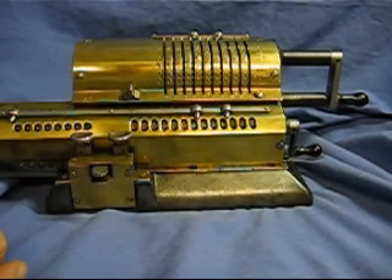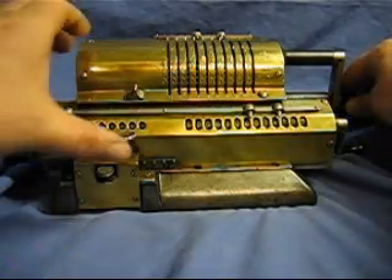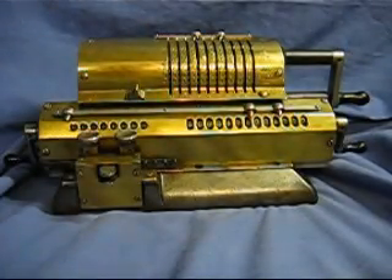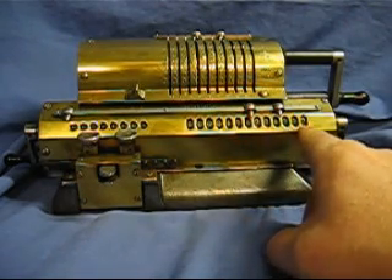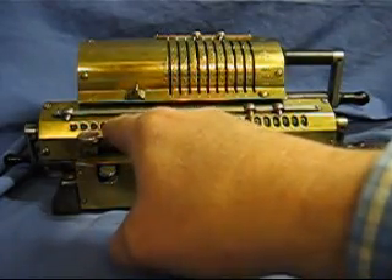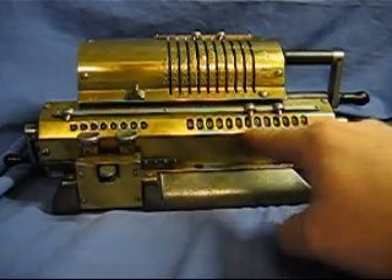That's very straightforward. Now you can perform more complicated calculations. You can move the carriage over once, twice, three times, four times, five times. And then we can turn the crank three more times — once, twice, three times. We see the result now is 133,201,332. The total number of turns is 300,003, and so 300,003 times 444 is this result.